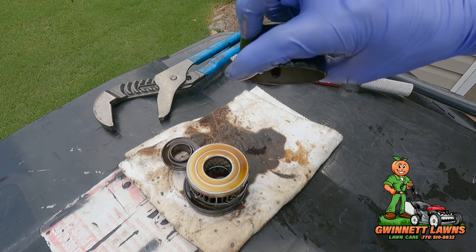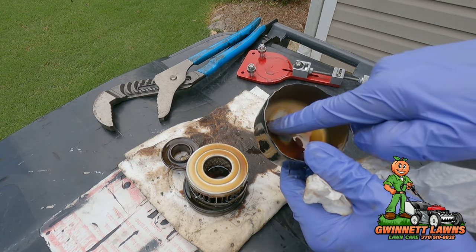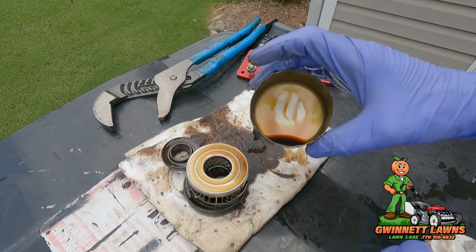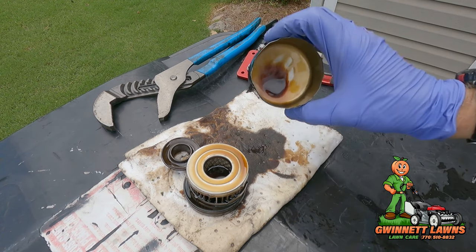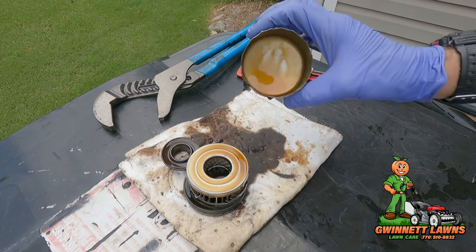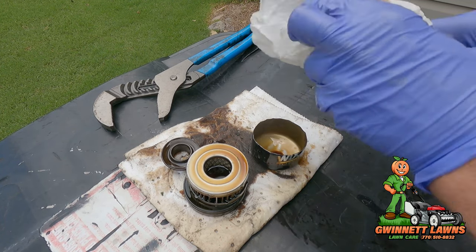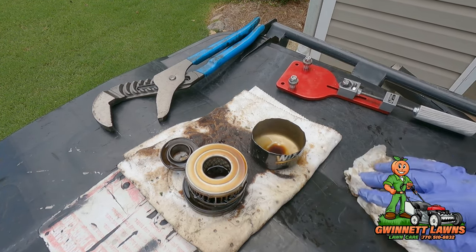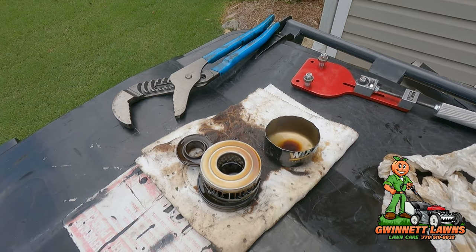This would have been additional wear on the engine that's not there now, because the magnet took it out, held it, and kept it from circulating. It's very evident — even more so in an automotive filter that flows a ton of oil. Try this, guys. I can't tell you definitively that your engine will last an extra 500 or 1,000 hours — I don't know — but it's basically free to do. Why wouldn't you do it? Put them on your cars, your mowers, motorcycles, whatever.